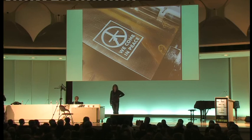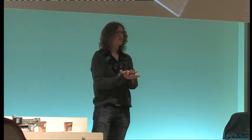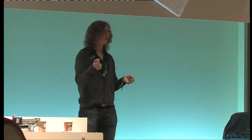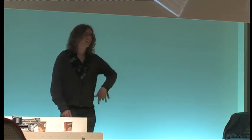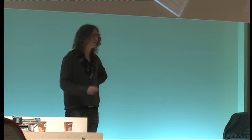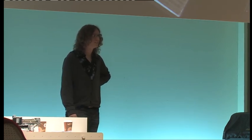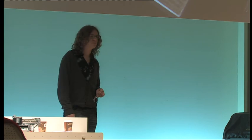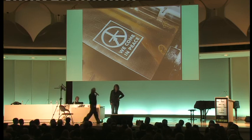How do you solve the problem of two-sided printing? Lining up two layers is obviously tricky, but I can imagine drilling some holes through to use as an index, then either lining that up with some mechanical fixture, or maybe a gantry with computer vision would be awesome. I've been mostly concentrating on the fundamentals of getting a wax image onto a copper surface so far. The real challenge is electrically connecting the two layers — that's the killer feature — and I don't have a solution for that.